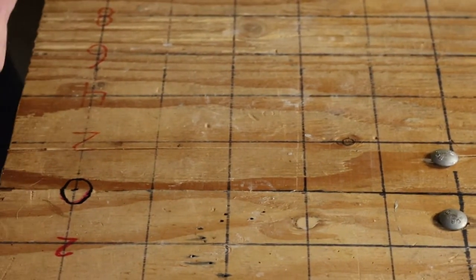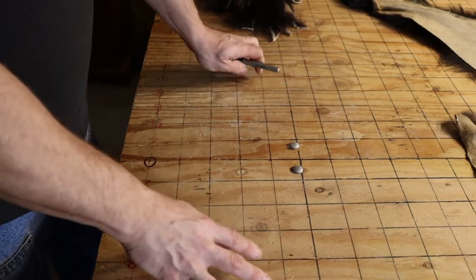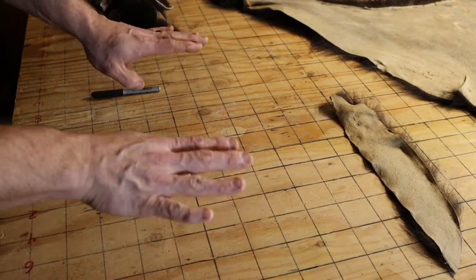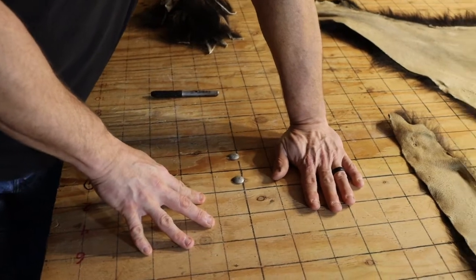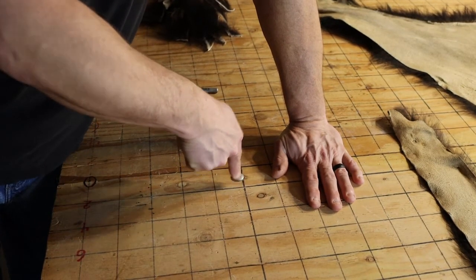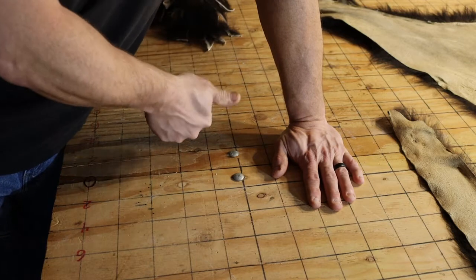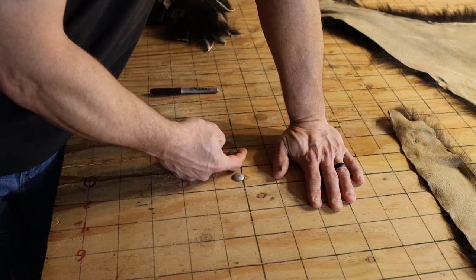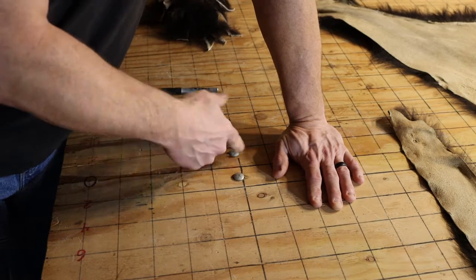So now that we have this point here, what you do is you run the boards back and forth over these 2 tables that are underneath and find the halfway point where there is an overhang evenly on both tables and a little bit of a gap in between the 2 tables to where it feels solid. Once you have that, you need to hold down with your hands, grab a drill, and you'll drill straight down through the board, through the plastic table underneath, and then you'll drop a carriage bolt in. And you'll do the same thing for the board right next to it. So you'll drill down through here. You'll drop one of those 3-inch carriage bolts in. You'll put two washers, a lock washer, and then a wing nut on the bottom of this. And the reason we use wing nuts is because we take this table apart when we're not using it. Like I said, we do some of our work in our cabin.